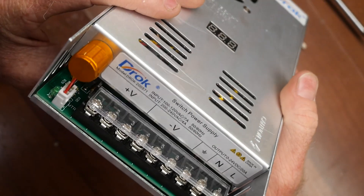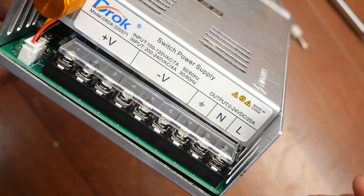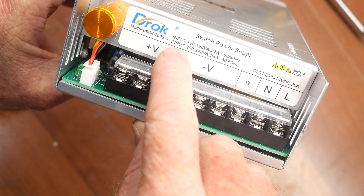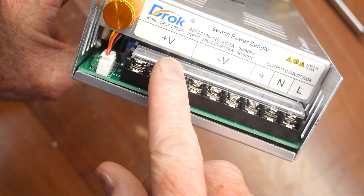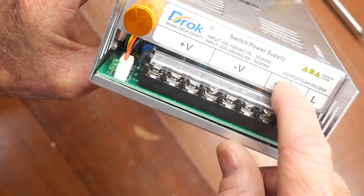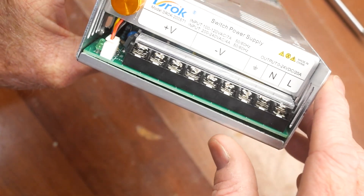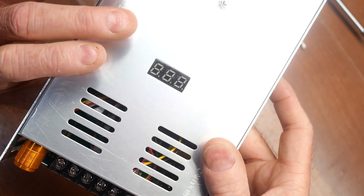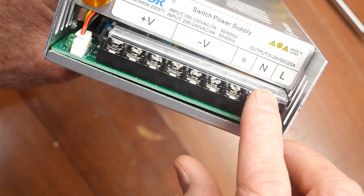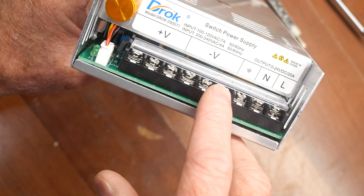I picked up a replacement power supply — this one had pretty good reviews, I'll leave the link below. I don't have any formal training in electronic nomenclature, and when you first look at this unit you see the words 'output' and 'input.' I thought you hook up the 120-volt positive and negative to where it says 'output,' but that's not the case — I hooked it up that way and blew my circuit. Turns out this side is actually the input: put the 120-volt neutral, load, and ground here, and over here is where you attach the LED lights. Just a heads up.